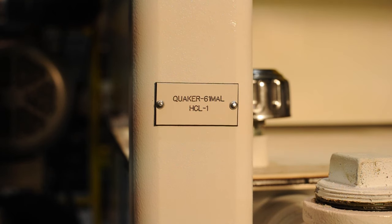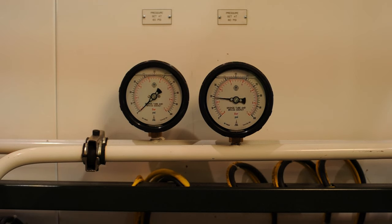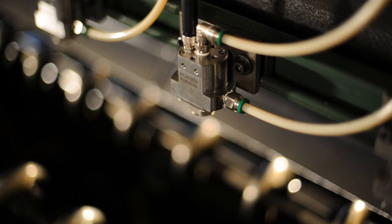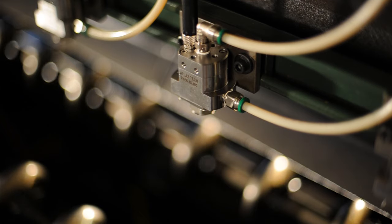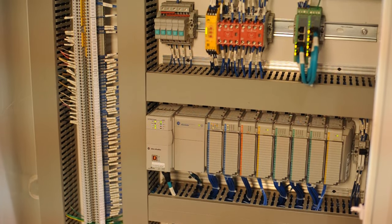The oiler featured in this video is a dual oiler. The customer runs two different fluids and wanted to change from one to the other with no loss of production time. This unit is two complete oilers — dual tanks, pumps, filters and nozzles — so changeover is as simple as just selecting a different oil, no purging the system needed, all in a single cabinet.